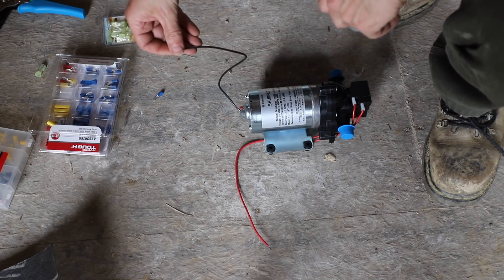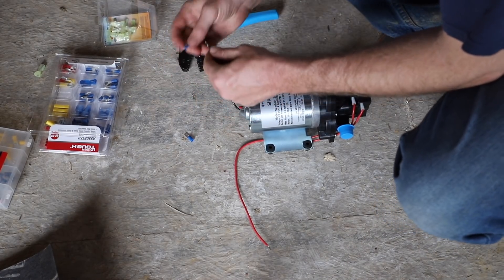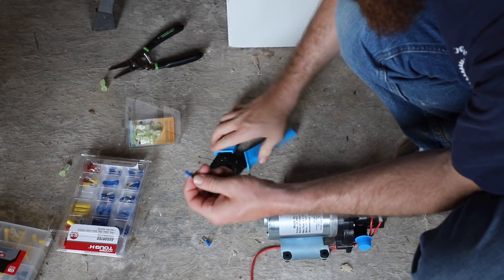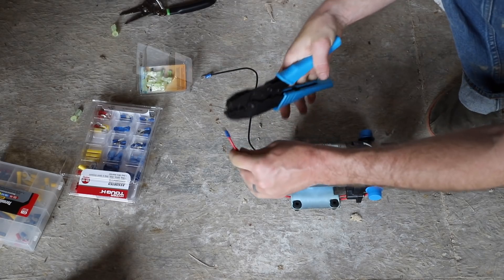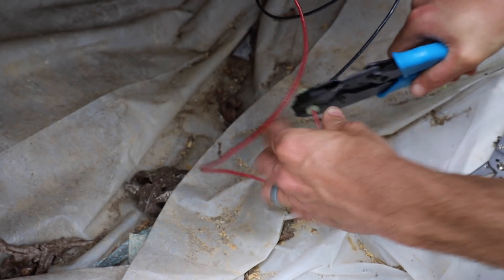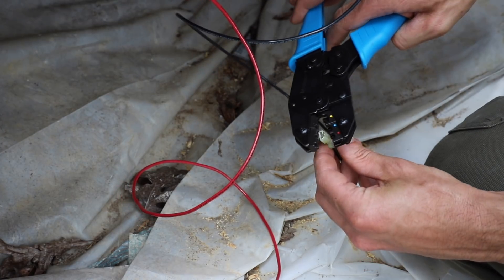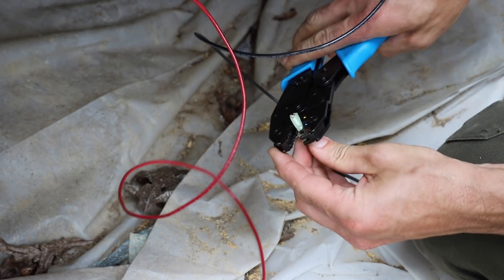This is my 24-volt pump. The one I have down there is an older 12-volt pump that I was using off a car battery charger. So I'm just putting connectors on the end and crimping them. Right now you can only switch the pump on from near the kitchen sink, but you'll still have normal faucets. All the pump does is make sure the system is pressurized, so you'll still be able to turn the water on from anywhere. It's not a municipal water supply, so there's no way to have pressure when your tank is below your cabin other than to have a pump.